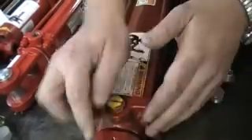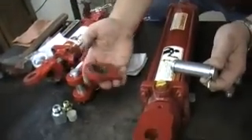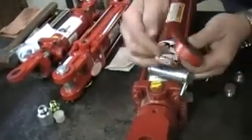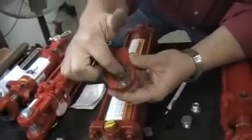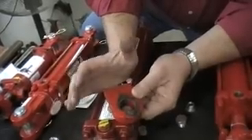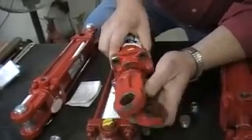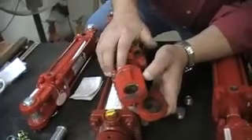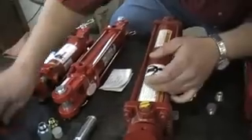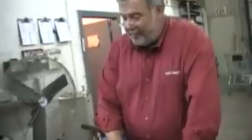All these cylinders have one inch diameter pins that fit into these holes, and you need to fill up the entire part of the hole. Here's an example of where someone had a smaller bolt in their application — the hole became egg-shaped because it was moving back and forth within the hole instead of moving with it, and at some point it found the weak spot and broke right off. That customer adjusted by finding a bushing to drive into the holes to allow for the smaller bolt, used in a shearing type operation. We'll take a quick break and come back to break down this cylinder and show you the insides.